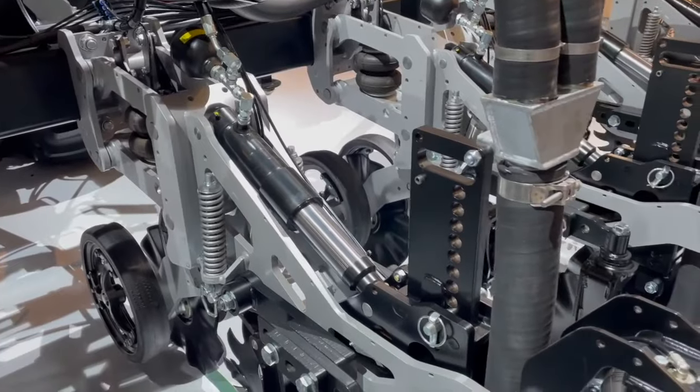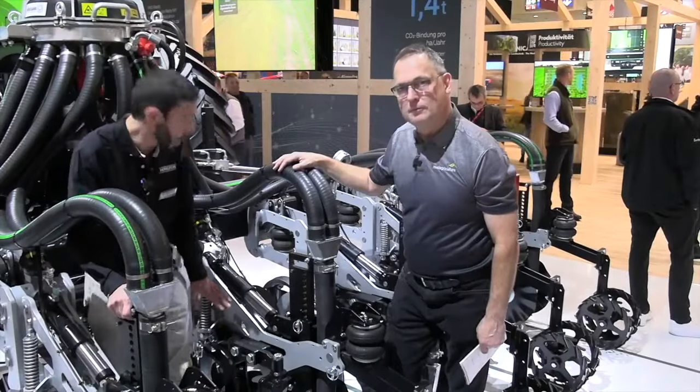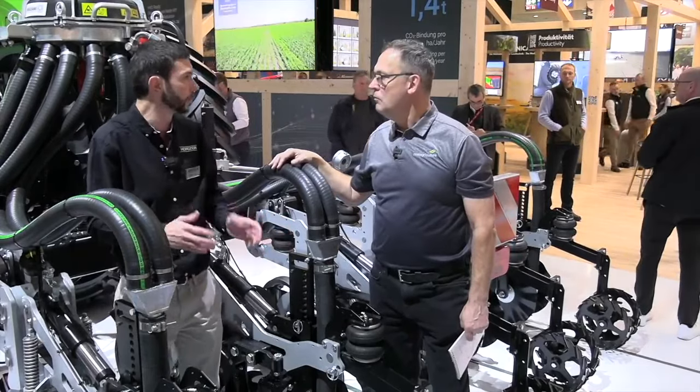What about the cleaning system? So the cleaning system — we use CleanSweep from Precision Planting, in-cab controlled by the air system. This moves any trash away from the leg to make sure we've got a nice clean black strip.